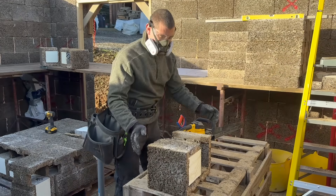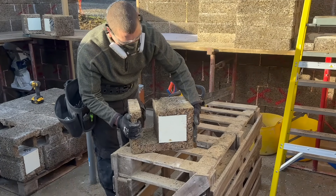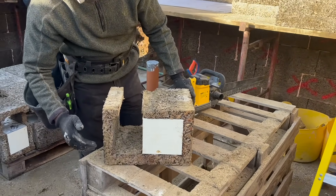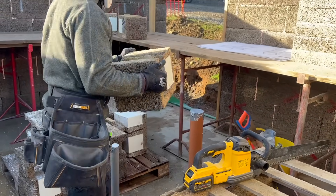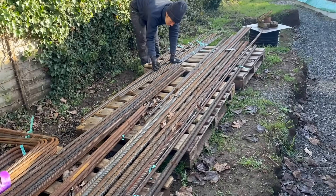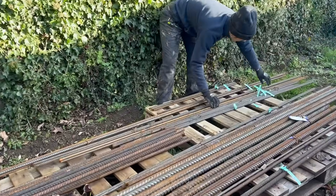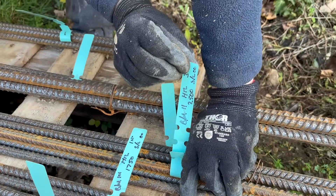Here I am just modifying a face block to create the 205 by 120 channel for the concrete lintel. We would then look at the drawings and with reference to the bending schedule, we would find the correct bar mark.